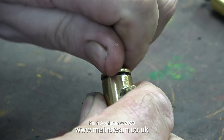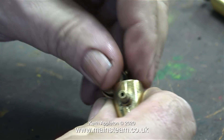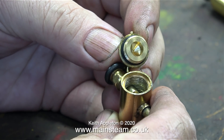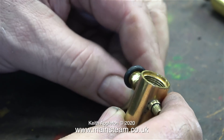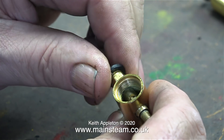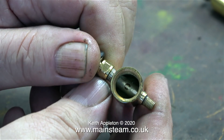Here's yet another design — a smaller lubricator ideal for smaller engines. You may have noticed that one thing all of these lubricators have in common is the fact that they are designed to screw into something. You can screw it into a hole on the steam chest or into a tee piece to put it in the steam line. But you must be aware that this is a displacement lubricator — it's the condensed water that comes from the steam in the steam line or steam chest that finds its way via the cross pipe into the lubricator.